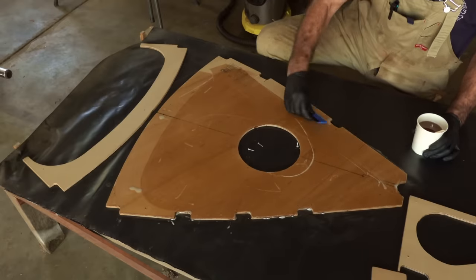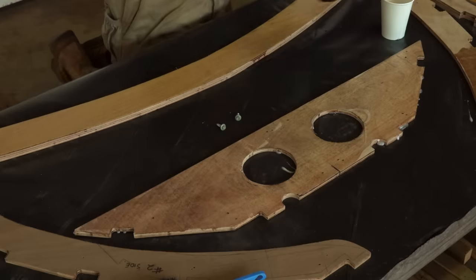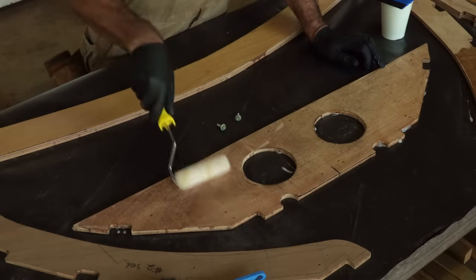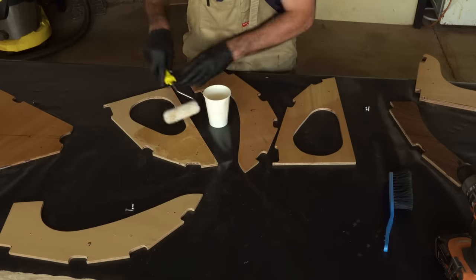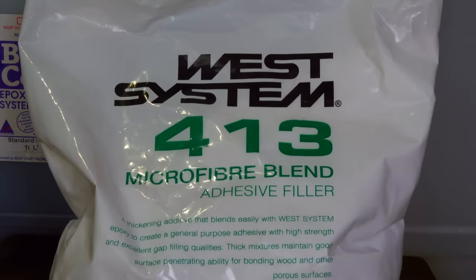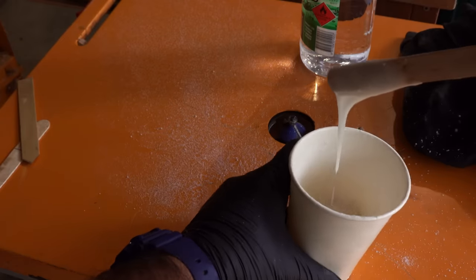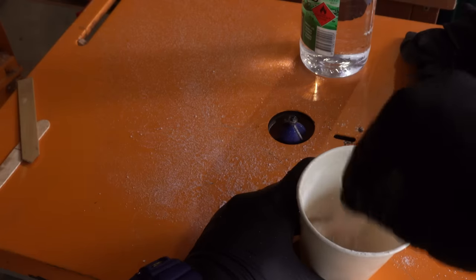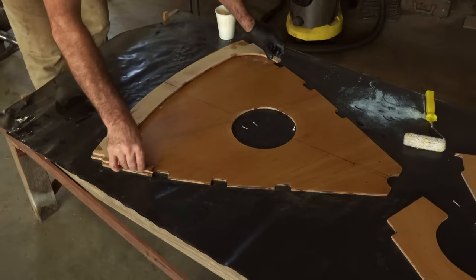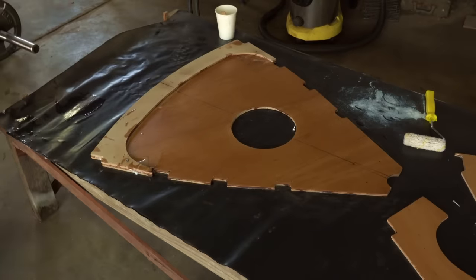Here we are wetting down the plywood so that when we come to glue the components together, the wood won't absorb the resin out of our glue mix and leave it starved of epoxy and weakened. I also use a roller to spread epoxy over more complex flat shapes, but pouring from a cup with a squeegee saves having to use a roller tray. Epoxy is thickened using a specialty powder to make strong glue — enough is added to make a honey-like consistency. By gluing together all the components before the previous coat of epoxy has cured, I can skip cleaning and sanding to remove amines. The screws are replaced back into their marked holes and pull everything into alignment, even though epoxy glue is fairly slippery.